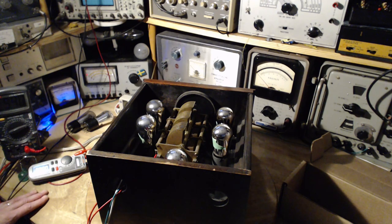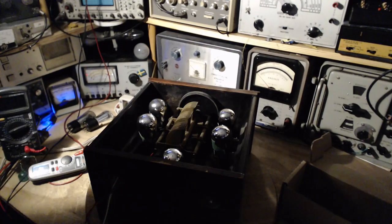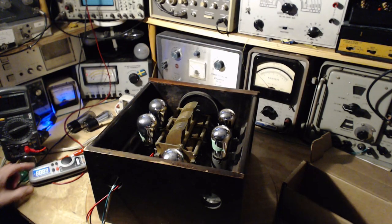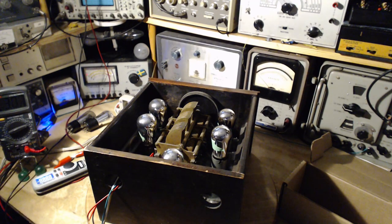Let's try again. Still have 5.4 volts. Overload. And if you look at what tubes are lit — I can faintly see this one. I would say 2, no more than 2. So this meter is not going to do the trick, it's overloaded.